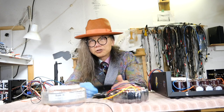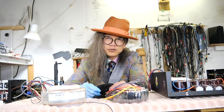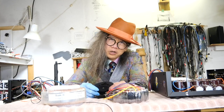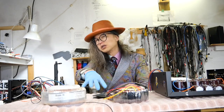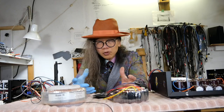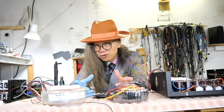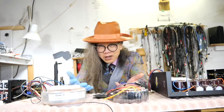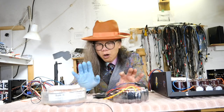Somebody will say, why don't you pour it in resin — this will eliminate the noise. No, it doesn't. It's a 60 Hz, 50 Hz hum. It doesn't matter how much you cover it, it will travel far. Pouring the transformer into one of those resin containers doesn't help with any hum and doesn't help with any vibration. The resin hardens and actually transmits noise directly from the transformer all the way out.